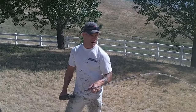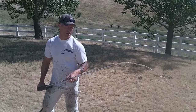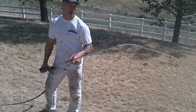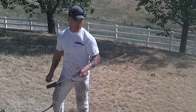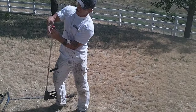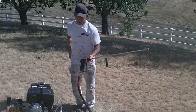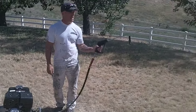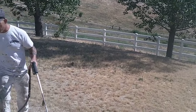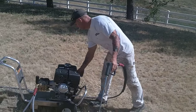If there's any air in the line, it'll come out. If there's air in the line when the power washer is running, the water won't come out. Once you see that it's all water, then put your tip on. Make sure your tip is on when you start the engine. It's a lot easier to start if you're pulling and holding the trigger — if you don't pull the trigger, there's a lot of pressure behind the engine when you go to start it. Now everything's in the on position and ready to go.